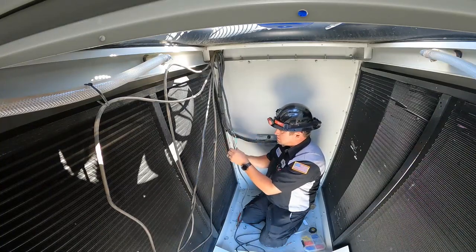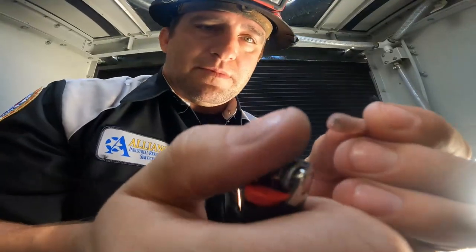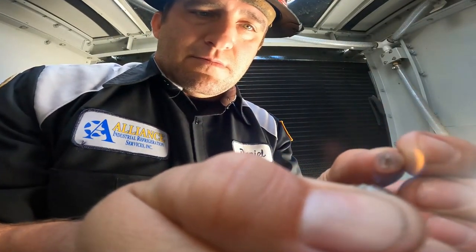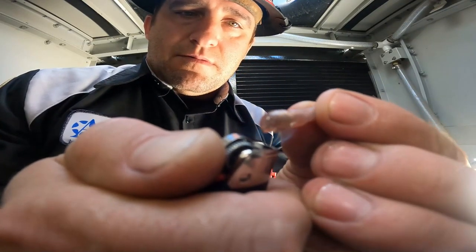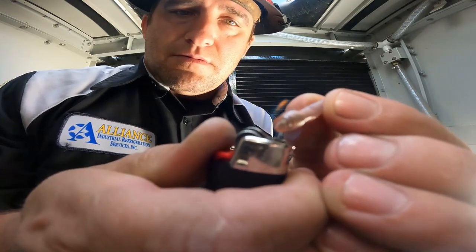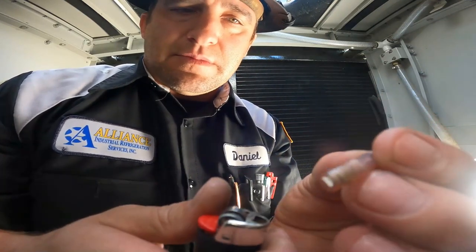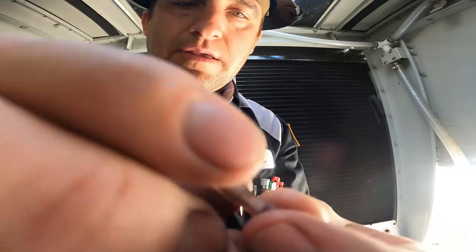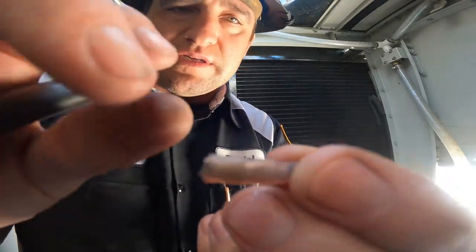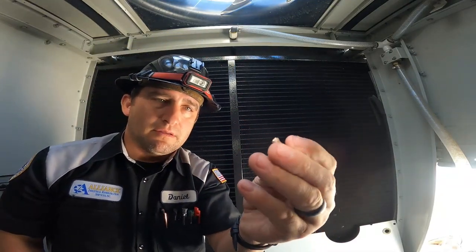See it gets smaller. Yeah, the other one they have here, they didn't do. Getting smaller. So now that's smaller, and all that solder runs into the wire. That solder in there, and that solder runs into the wire and makes a better bond. So if you're using these, you use a heat gun or a lighter, you know, see, now that bubble is completely, it's like gone now.